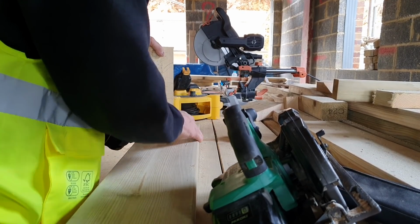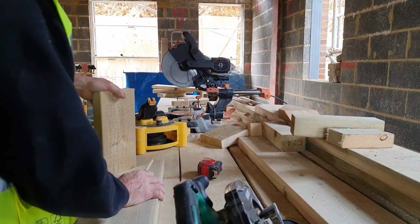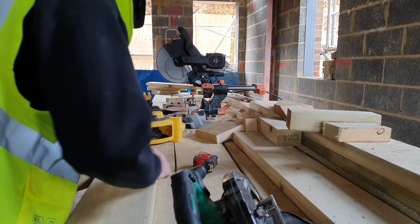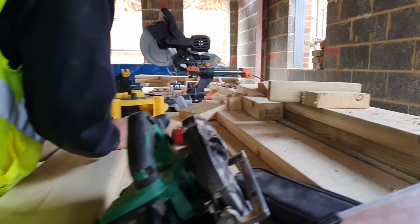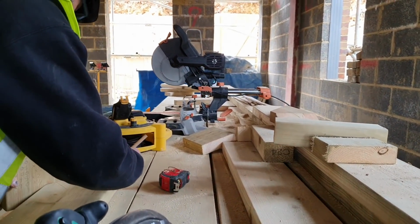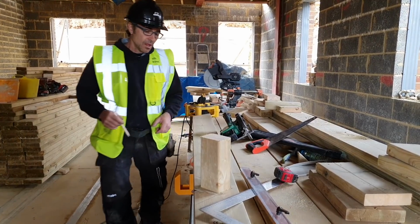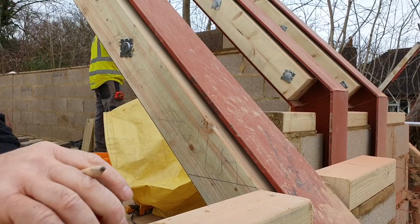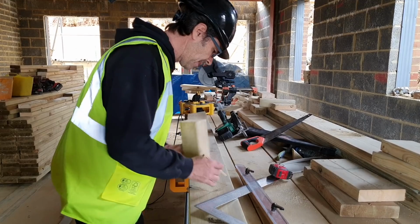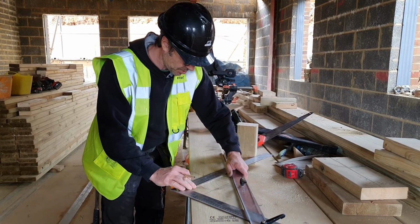So if you want to go like that, then that wall plate needs to drop. Yeah, or you've got to have a rethink and bird's mouth everything over the top of the steel onto a ridge with a ridge behind it, but only restrict the height of it so your build-up's not affected. Well, let's just work that out. So if we did go on the wall plate that's there at the minute, the difference is between there and here, how much it will be pushing it above.